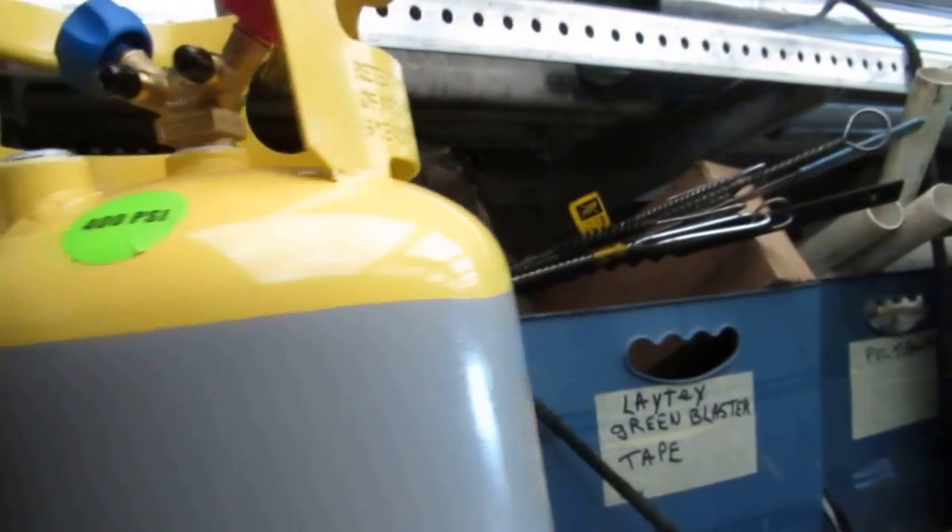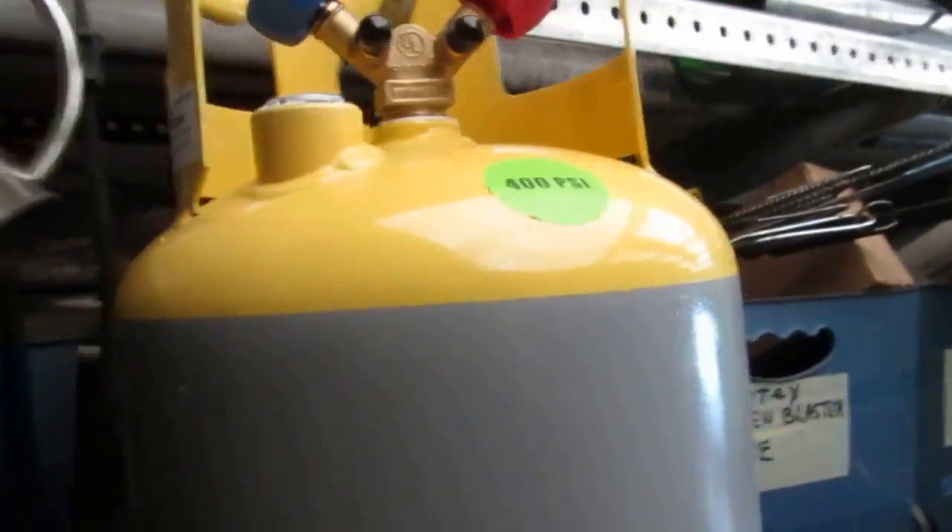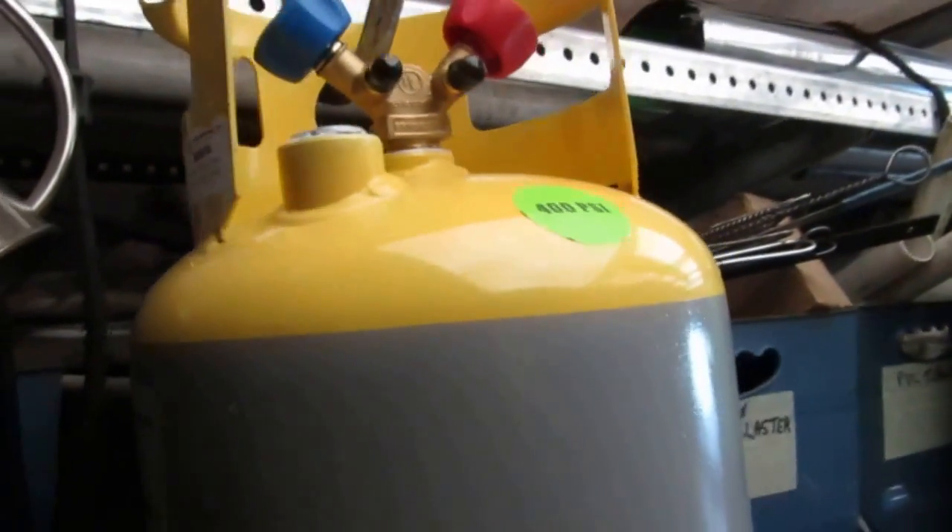I know there's a lot of stuff here, bear with me. This little container over here is all small PVC — three quarter, traps, nineties and forty-fives. This thing is loaded with PVC stuff for running condensate drains. My little 30-pound tank — I use it as a spare recovery tank for switching refrigerant if there's too much gas in a system and I need to save some and put it back.